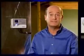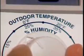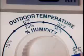If your installation requires manual mode, be sure to anticipate any drop in outdoor temperature and reduce the humidity setting to avoid excessive condensation. For example, with an outdoor temperature of 20 degrees Fahrenheit, the correct setting should be 35% relative humidity. If the temperature is expected to fall to zero degrees Fahrenheit, reduce the setting to 25% several hours before the temperature drops. It's important to make the proper adjustment to avoid condensation, which you may see as fog or frost on your windows.